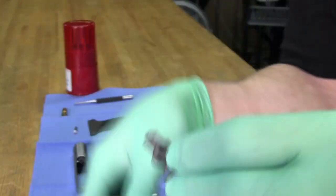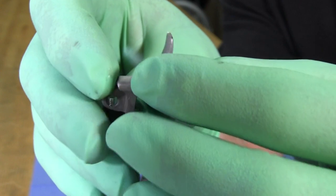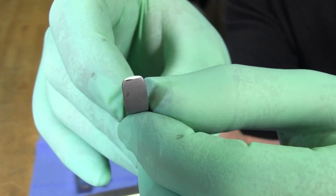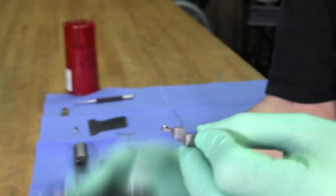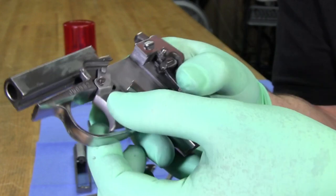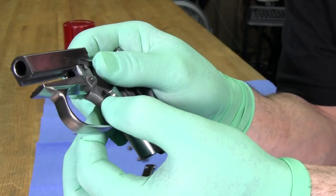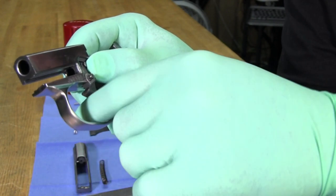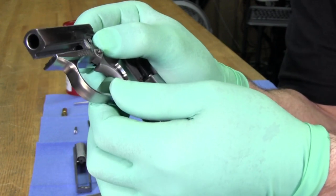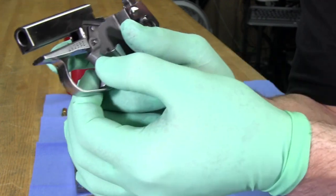Easy fix — all you've got to do is take a bastard file. I took a pretty fine one and just notched out the tip of the trigger. Very easy to do, and now the problem's gone. I think there are two problems here: if this were a tight fit between the trigger hole and the pin with less slop, the trigger would have still been too long, but when it hit the scratch point it wouldn't have had enough play to move far enough to the side to clear and jam. So it could jam to the right or the left, and you had to press the left or right side to get it to release.